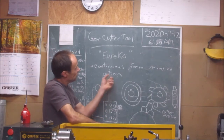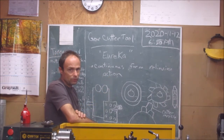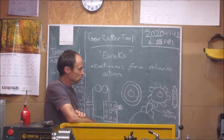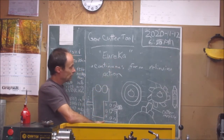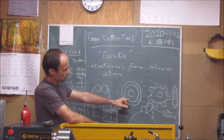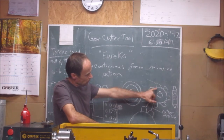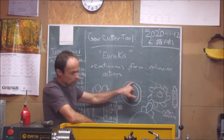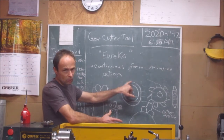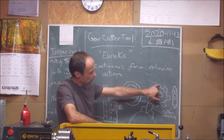So I started looking at this one thinking to myself, well, if I need my own cutters — I'm going to try to make this tool. First, if you look at the geometry of the cutter, if you don't have a relief angle, it's going to rub and cause excessive wear, and it may not cut at all. You've got to provide a relief angle.